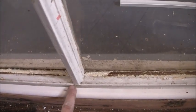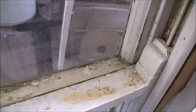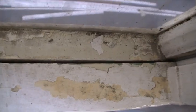Okay, so this is the bottom where the staff bead here is meeting up against the bottom rail, and that is completely filled with a brush. You've got to look hard in there to see it, but basically there's a brush that's running all the way along and all the way up through that gap. So that's sealing that right up to that point there. Okay, then we have the continuance, which is the parting bead that goes all the way around the top, and then all the way along here is sealed with a brush as well, which I don't think you can even see from up here.